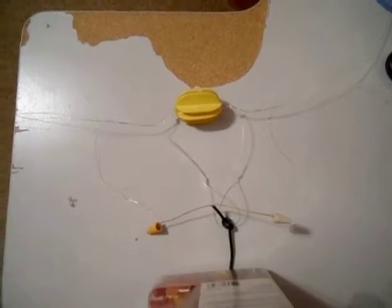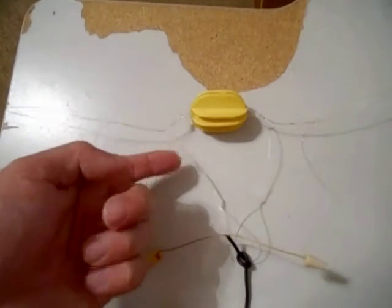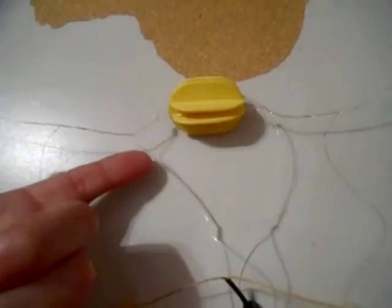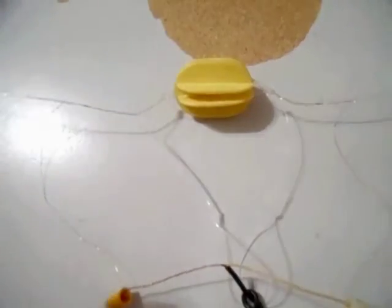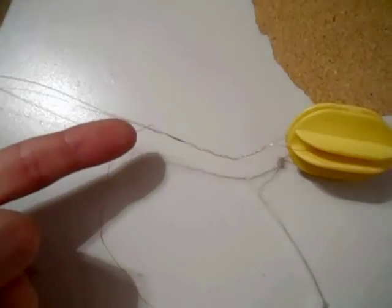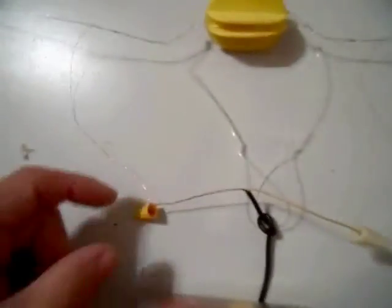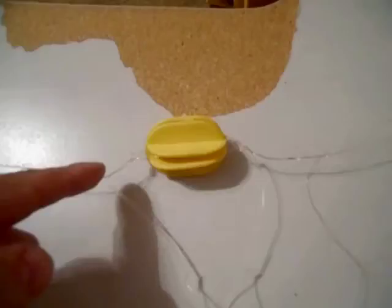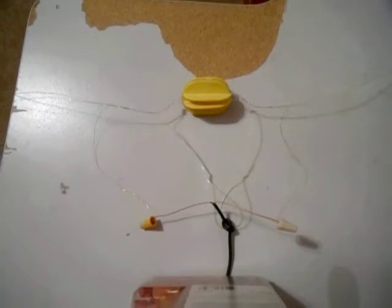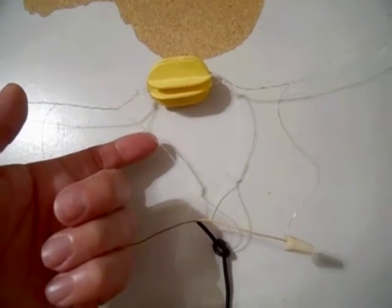Right here, you can see my new idea. First thing, we're going to string up some thick fishing line to support everything. I tied the fishing line to the insulator with two figure eight knots. And leaving some slack, I brought the two ends of the fishing line down and tied figure eights onto them to support the cable down here. The fishing line supports the enameled copper wire, which comes down and connects to the wire like this. I just twisted the ends of the enameled copper wire back around itself and the fishing line. So this way, you can take the enameled copper wire and loop it around the antenna many, many times, adding up to a mile of wire or more.